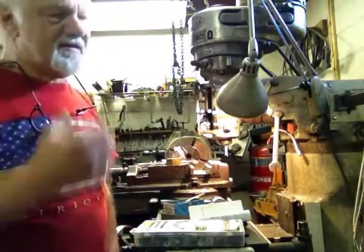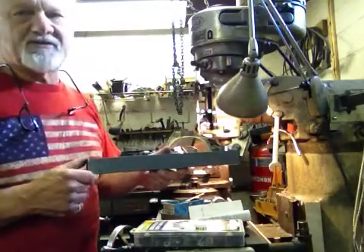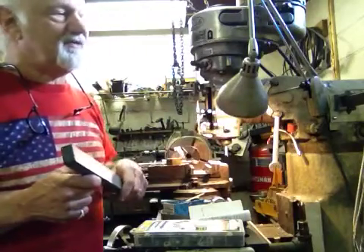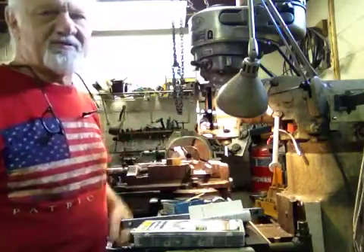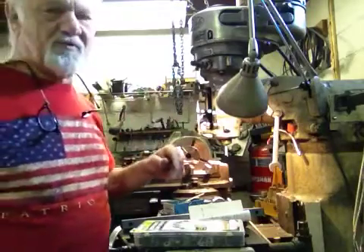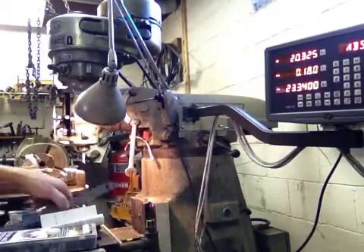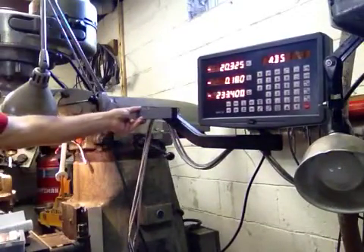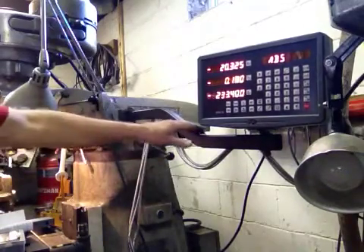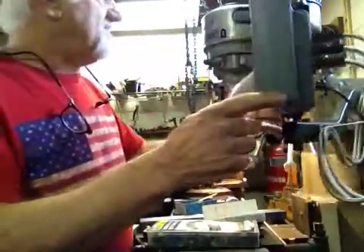The first thing I did was mount the display unit. The DRO came with a shorter extension arm, but I had an extension arm from an old Accurite DRO and decided to use that one to get the DRO closer to the front of the table. This old extension arm is much longer — probably double the length — and the advantage is I can really swing it out close when I'm working with it.